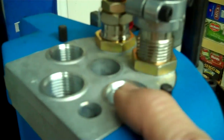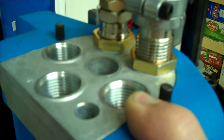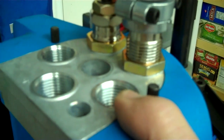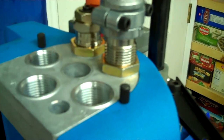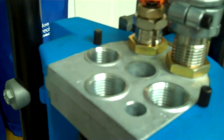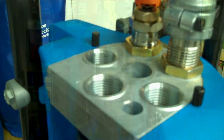In station number three, I'm not going to put anything in there. If I were reloading up to maximum velocity, I would go ahead and put a powder check in there, but I'm going to be loading mid-range, so it's not necessary. And in station number four, I'm going to put the bullet seating die and I'll show you a little trick there as well.